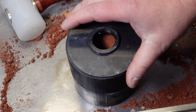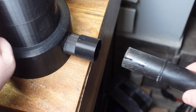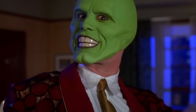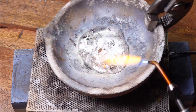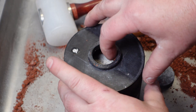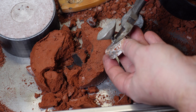Regarding the metals you can use, I've gotten it to work with aluminum, Zamak, and zinc, but I think any metal will work provided you get the metal hot enough — it needs to be heated significantly hotter than you would normally cast at. And it only works with the vacuum setup. This is actually one of the reasons why I made the vacuum attachment for the everything machine. I've tried it with regular gravity casting and it doesn't work — you need a strong vacuum to pull the metal into the tiny voids.